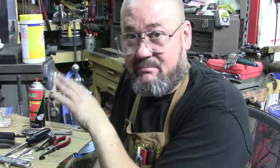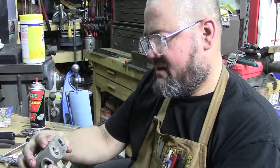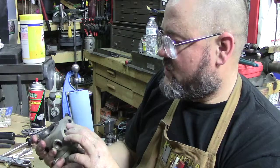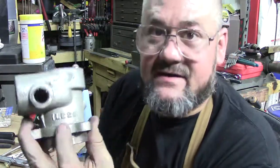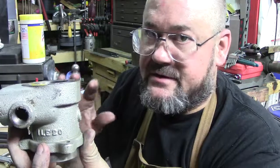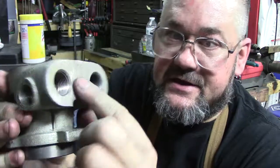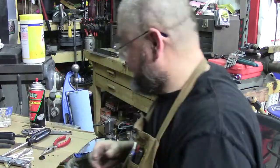I did get it cleaned up. It doesn't show a name brand but it does give the pump number: 1LE7420-alpha, and it says ILE20 on the side. For those in the hydraulics business you probably know what size pump that is. From working on Cessna pumps I know you'd order a kit for this style - it's a gear rotary style pump.